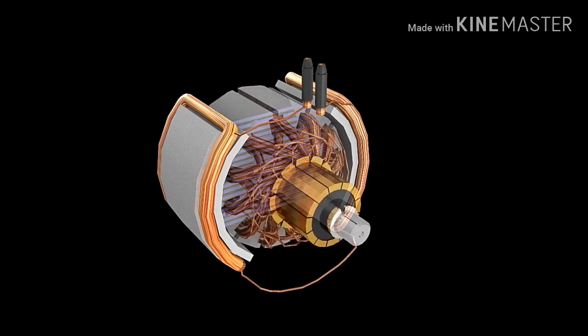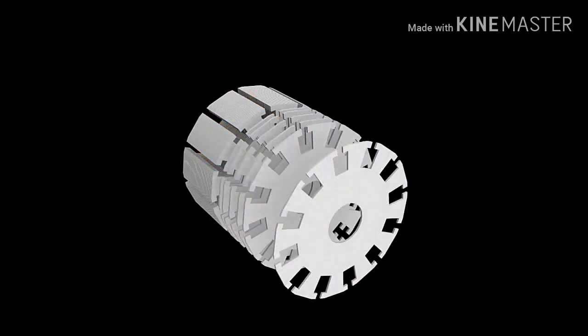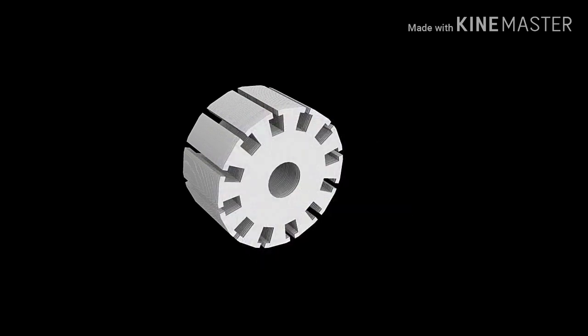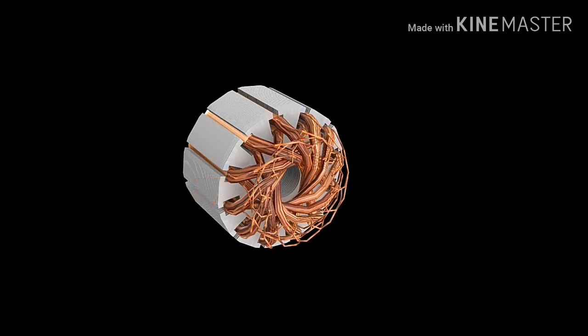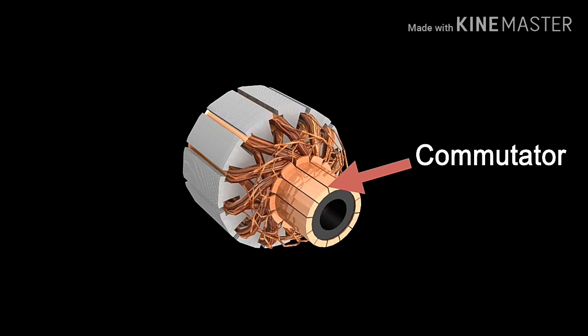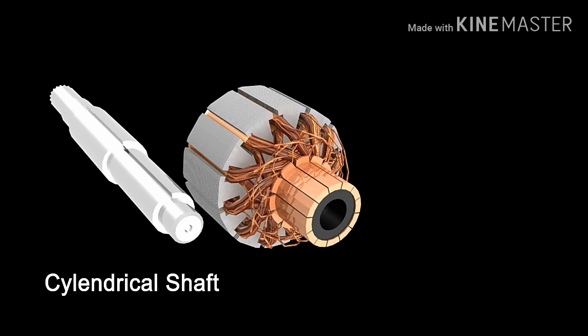In this magnetic field, the rotating part of the motor lies, known as the rotor or armature. It is made from a number of stampings of highly permeable material — silicon steel — which allows the magnetic field to pass through it easily. Slots are cut on the outer periphery of the armature to receive coils of copper conductors. Each coil gets connected to an external DC source by a pair of commutator segments arranged in the form of a ring.